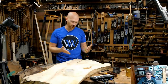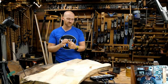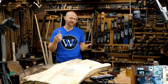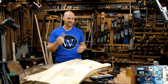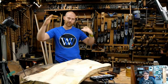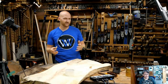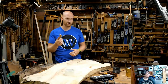That then brings me to the question of where do you need to use these? And most of the time, you don't need to use these. Especially if your furniture is going to be in an air-conditioned world, it's kind of superfluous. If you're going to be doing something like an epoxy fill, a lot of times it's not needed. Like the two desks I have, cracks that are over 6 foot long, going from 3 inches at one end down to nothing, and I don't have any bow ties in them. The epoxy holds it together very nicely. But if this is going to be something that is in a lot of air movement, it's not constantly air conditioned, then bow ties become very, very useful for that.